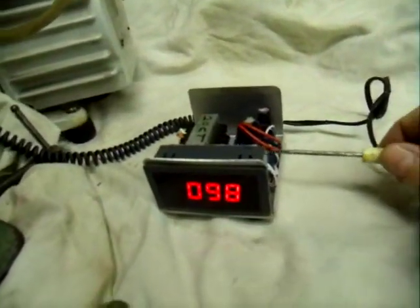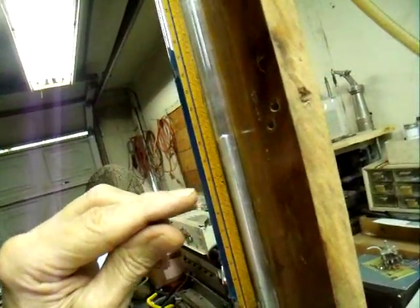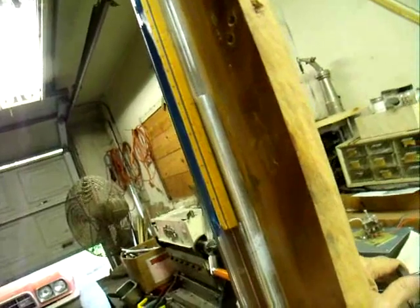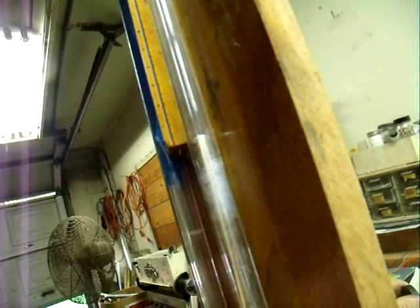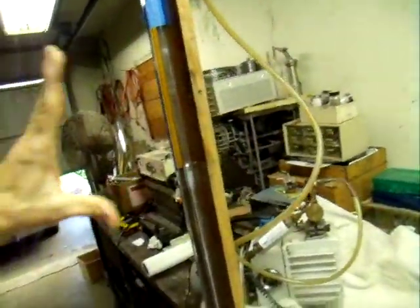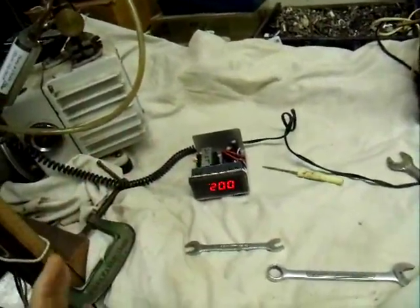I'm just going to bump that up by one. Now that should make them all accurate. Let's continue on down to 200 and see what happens — 200 is going to be right at the bottom of the ruler, which makes sense. Look at that — within one count. So we've used a mercury column U-tube manometer to calibrate our digital gauge to an accuracy of one torr.